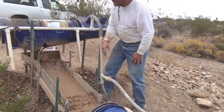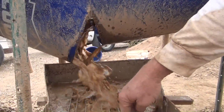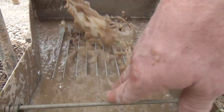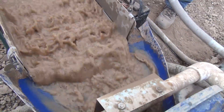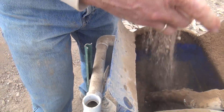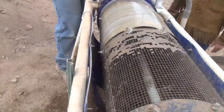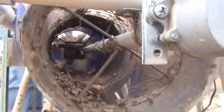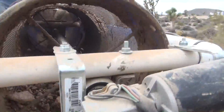The other thing we added is that when water comes off the trommel it's all turbulent. So I added these little ventral fins down here that help stabilize the water, so as it flows over the riffles it's flowing with more of a laminar flow — you get better contact and better recovery. You can see how everything is washing. This little metal plate I added to the trommel helps mix the material for better washing, especially with the muddy creek clay we're running through here.